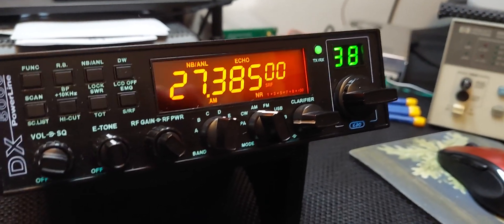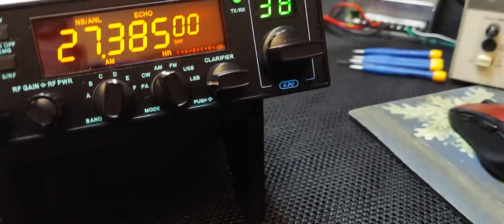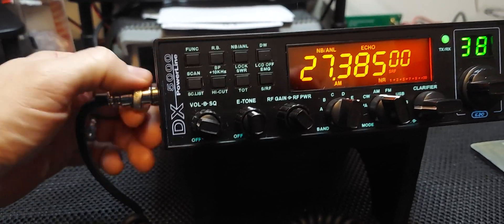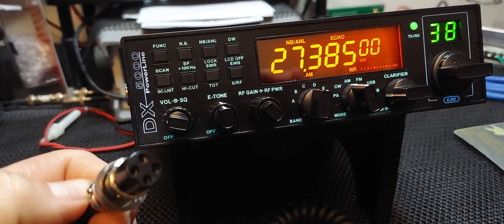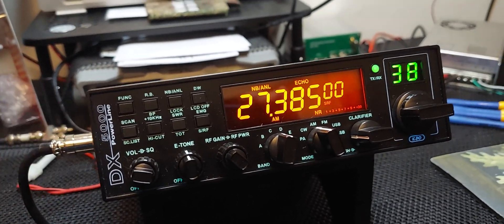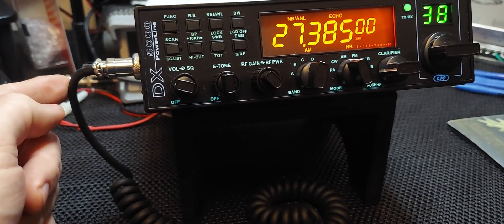I have a 532 KPO microphone here, wired for standard 4-pin, so the receive wire is enabled on this plug. This is just a 4-pin extension cord. What I've done is on this end of it, I just took apart the connector and disconnected the 4th wire on the plug. So now there's no 4th wire connected. We didn't have to change our microphone — we just changed the extension cable. When we TX, the 4th wire comes through but then it stops here because it's not connected to the jack, so there's no voltage present going back to the mic.